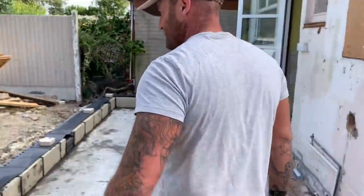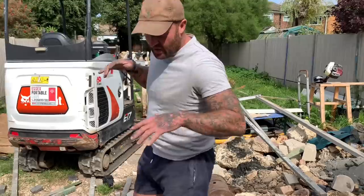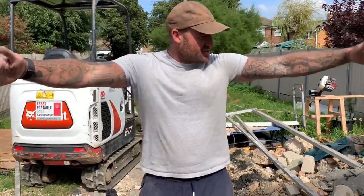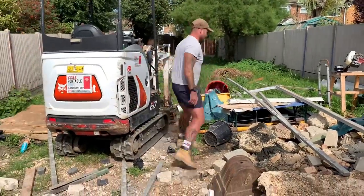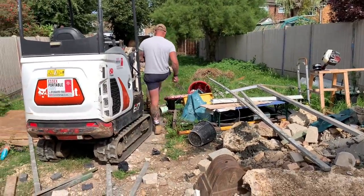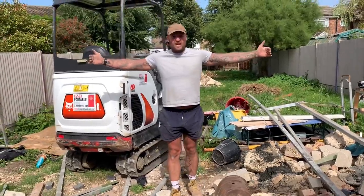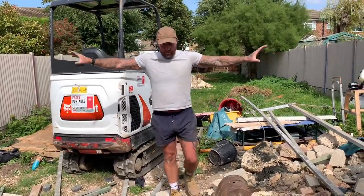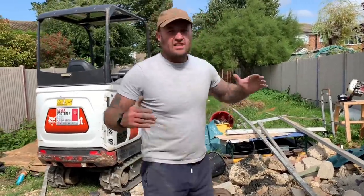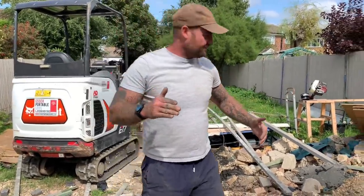Come round here, look at this. Who works like this? He's asked me to give a price to do the patio. Now, on these single extensions, I worked with an architect about two years ago. Fantastic idea. When you come out square, if you stay there, bring a patio line out to here, then put a border down or step, and then extend another patio out to here. Then on the sides, do two block work walls, either paint them white and add mirror features in. What that does is give you an extension of the room. When you're looking at the bifolds, the 3 metre extension then looks like 12 metres because it looks all as one. So when the bifold doors open up, you've got all one. If you keep your lines sharp and symmetrical, very modern, it looks unbelievable.